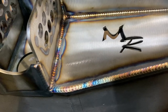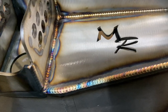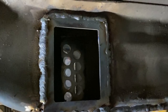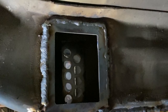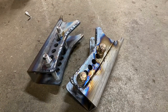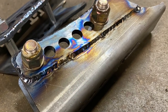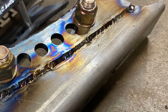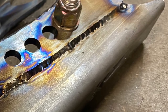Once you get all this stuff adjustable, it's very important to go find yourself an instant center calculator — that'll give you a real good idea of where everything's at. There are some good programs out there. Start plotting out the instant center location and what your anti-squat is, and with this adjustability you can make it whatever you want it to be. By doing these upgrades you're setting yourself up to have a much better, more consistent program, and that's all we're after — going fast and getting win lights.